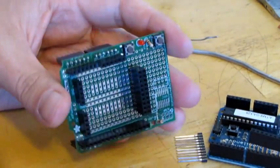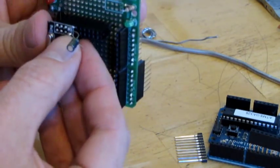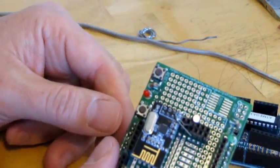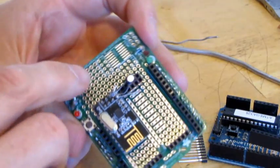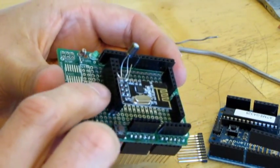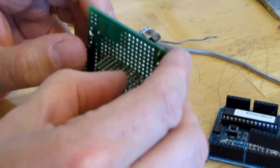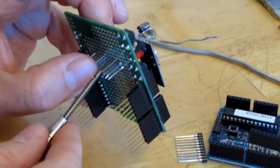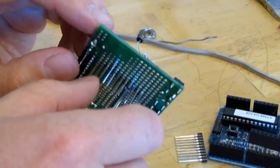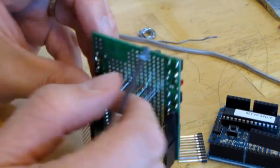And we could start to plan our attack for doing the wire wrapping. As usual with these kinds of things, the problem is having to look at stuff upside down. We're going to put the NRF radio in these ones, in that position. Pin number one, we want to pull the pins out to here, and then we can use regular wires to connect them up this way. This is where I get a little lost sometimes. Pin number one is going to be this pin right here. According to my little diagram, pin number one has to go to ground. But what we're doing is pulling that out over to here. So we're essentially moving these pins from the NRF over to this bank over here so that they're a little easier to manipulate.